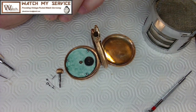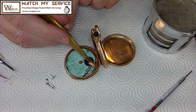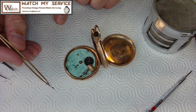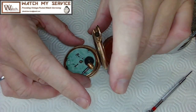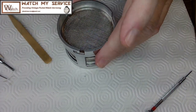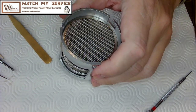I stack the remaining parts to be cleaned by hand — the crown, the pallet fork, and the watch hands — into the tray, making sure there's no pressure down on the sub-dial. Now I've got everything contained. This won't close without the stem, so I set it all aside ready for cleaning and reassembly. That's my video — thanks for watching, and stay tuned for the next cleaning of this 1897 vintage Waltham pocket watch. See you later.